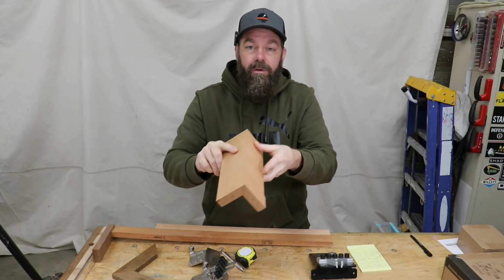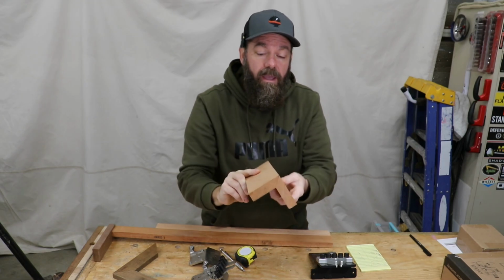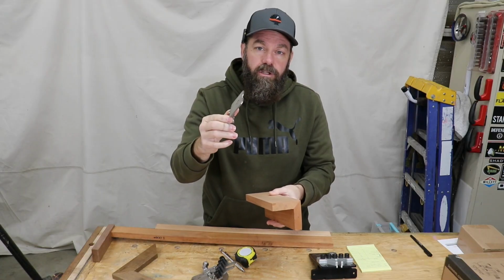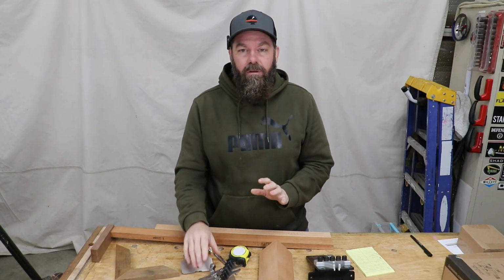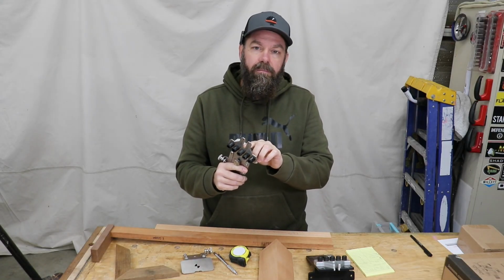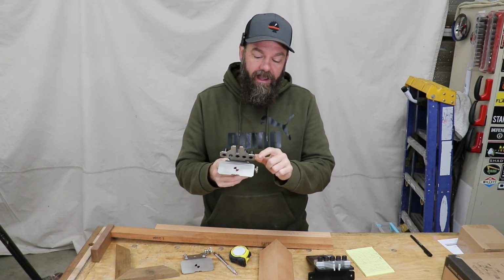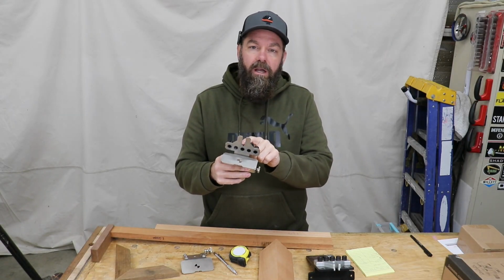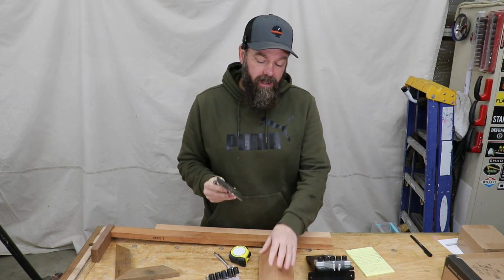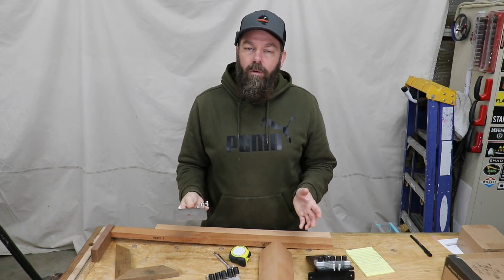And you can see it went together just really nice. I mean, the joint there is just perfect. And it was pretty easy to do with this new 45-degree attachment. So using this new stainless steel jig was really similar to the old style jig as far as using the alignment slot and how you line everything up. This does add a couple little notches for alignment, which did come in handy. And using this 45-degree plate to make this long miter was intuitive, simple, and really no problem at all.